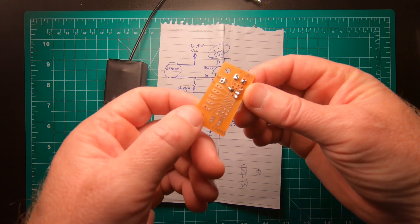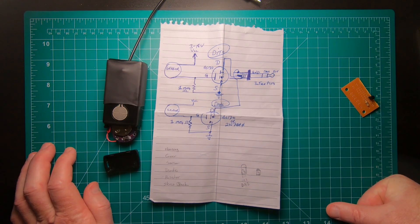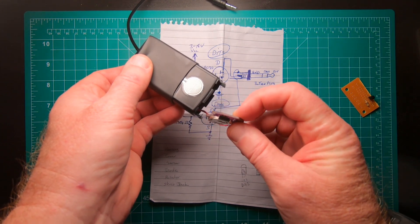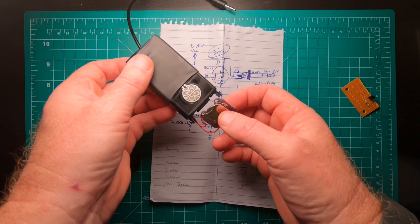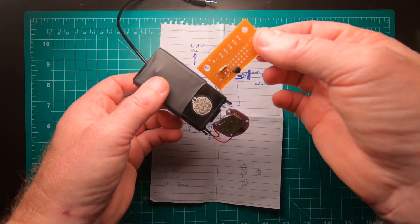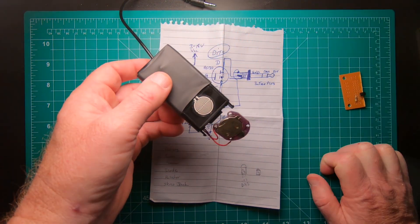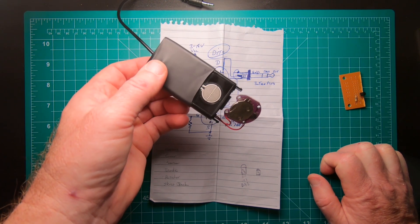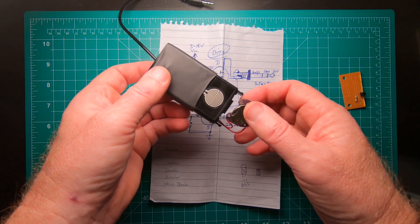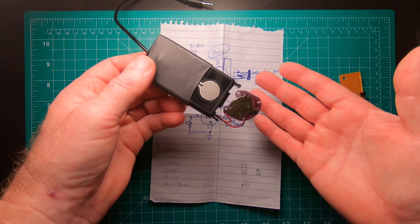He sent me everything but the housing pieces and the battery enclosure. I used a portion of an old RadioShack PCB board to solder all the transistors, resistors, sensors, and stereo jack together. I ordered a plastic enclosure from a website as well as a wafer battery holder for the 3-volt wafer battery. I put the circuit parts I had soldered and the wafer battery all connected together in the enclosure. Tim said that as he experimented with the circuit, higher voltages were more sensitive, but there were some slight issues with this paddle — sending unwanted dits — so it was really sensitive as is.